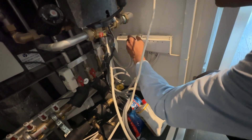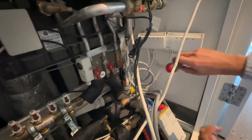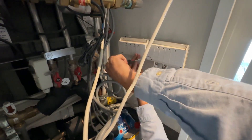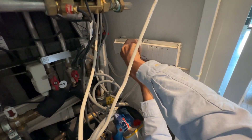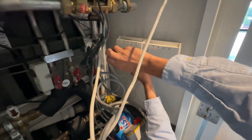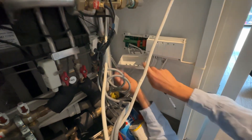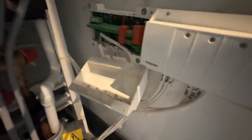There's one more screw to get — down and dirty. There we are, it's under here. It's the poly pipe underfloor heating system. Let's take that panel off and get to the fuse. It's held on there, so this one spins down rather than pulls away, and your fuse is in there. I recommend before touching this that you turn the five-amp fuse off at the main heating spur.